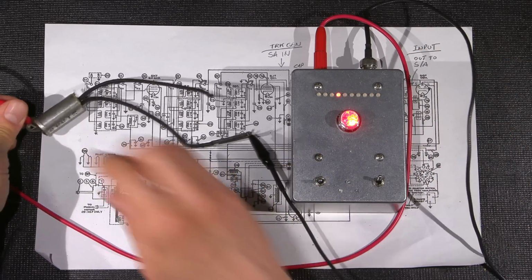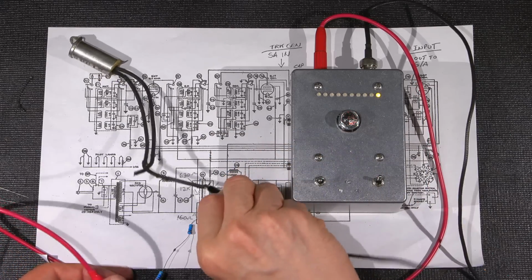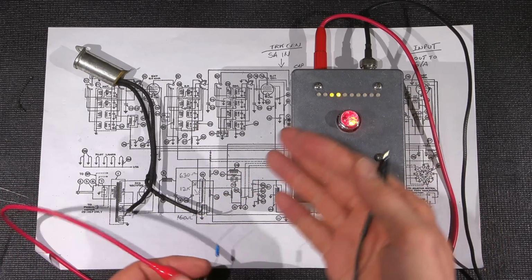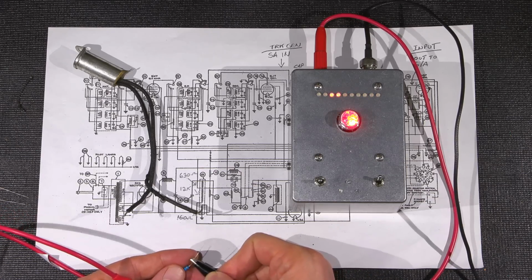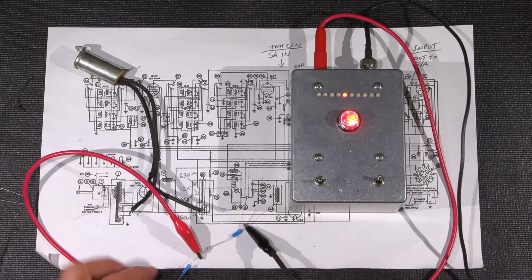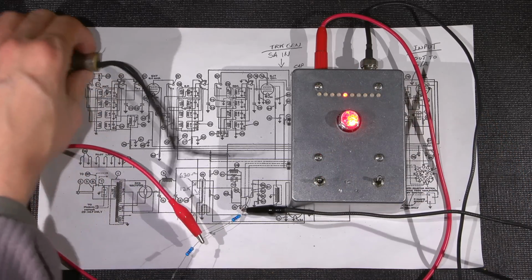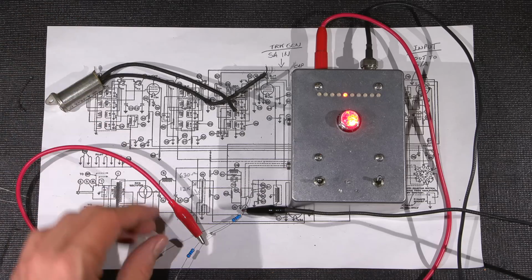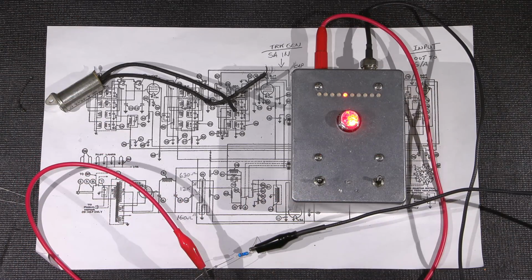So very, very bad. You would actually be able to read this. It's so bad, you could read that on a standard DMM. Okay. This here goes way beyond a standard DMM. So there you go. That's 20 megohms right there, right across that one resistor. And we're below 20 megohms with this. If I was to put this across a DMM, it's going to read very close to, I'd say, between 10 and 15 megohms. Okay.